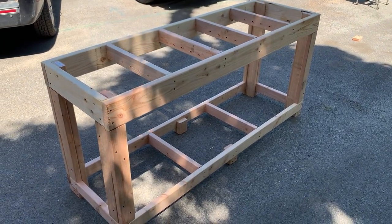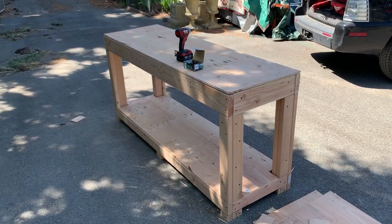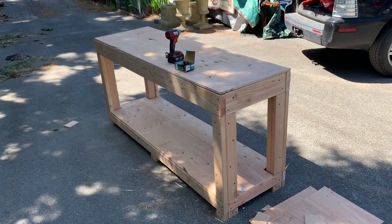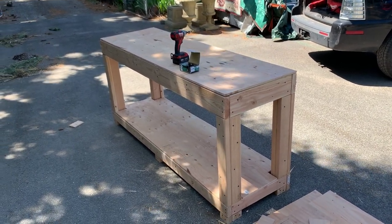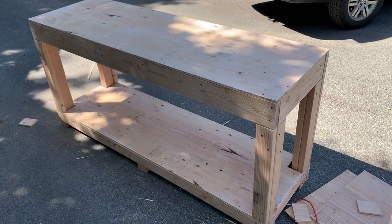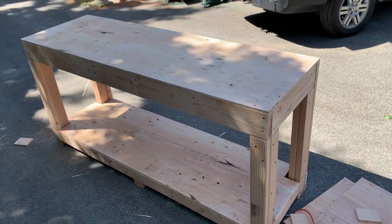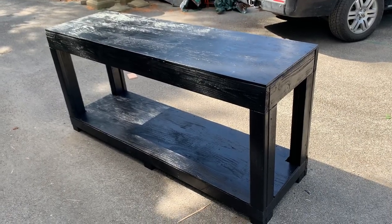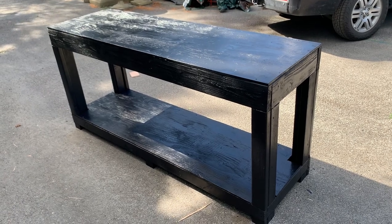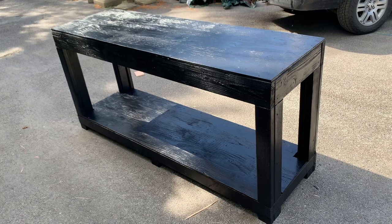Plywood's cut, now it's time to screw it down. We're going to make sure we screw from one side to the other to eliminate bows in the middle. We hit it with the sander after we screwed it down — now she's ready to paint. There she is painted. It's still wet but it's got to dry. Once it dries, we will take it in and set it up.